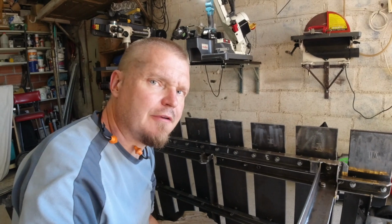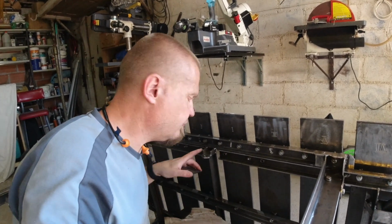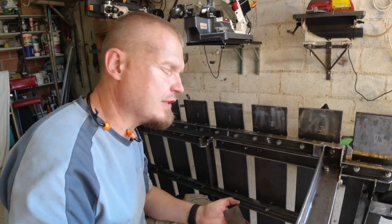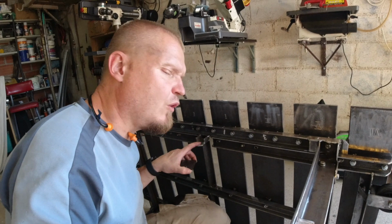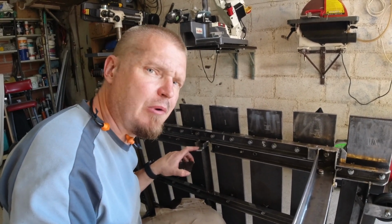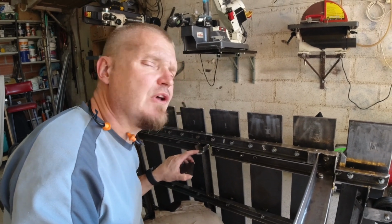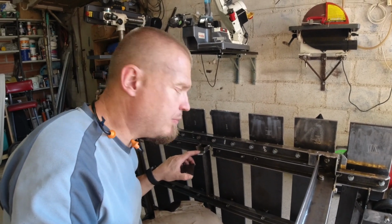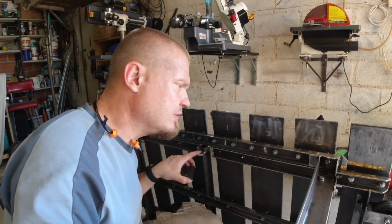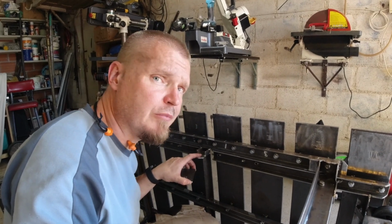I think I have a plan. My initial thought was that I'd just use a flat bar from the pivot point to the leg and be done with it like that. However, this hole isn't 8 millimeters, and an 8mm bolt and an 8mm hole isn't very accurate anyway. So if the whole idea of this is to make it not wobble from side to side, then I shouldn't be trusting the bolt hole to be keeping it tight. It might work, but it might also not.